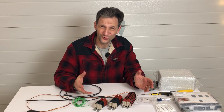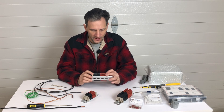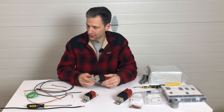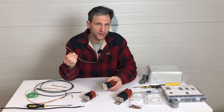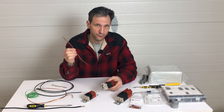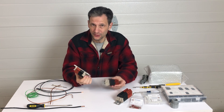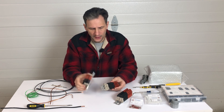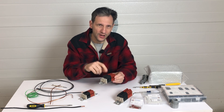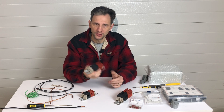Overall, I'm really impressed with how these perform. After that analysis, I'm going to go with the DK6N, which is good for up to 8-gauge wire. I do have a number 6 ground wire, but I think I'm going to put that on a ground bus bar. This will give me margin. The DK4N can technically handle 10-gauge wire — that's the largest size I have — but Clayton's recommendation is to go one size up, and you can put a lot more force on the DK6N screws. So we're going with the DK6N. Let's put it in the box.